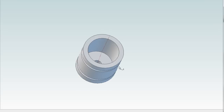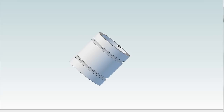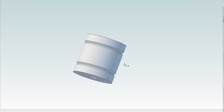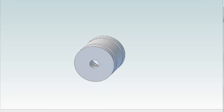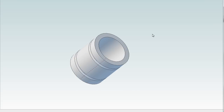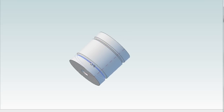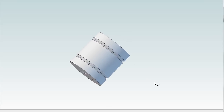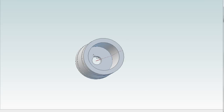It's tiny, and it's machined from graphite to minimize friction as it's sliding back and forth inside the cylinder. There's a hole drilled all the way through it, and this is for attaching the drive rod that comes up through here. There are two V-grooves that are machined into it, as you can see, and then of course there's a boring in here.